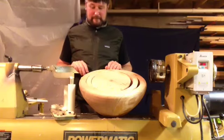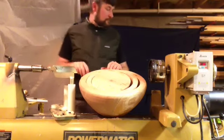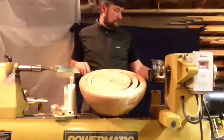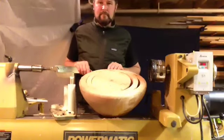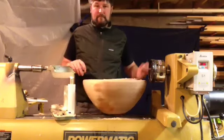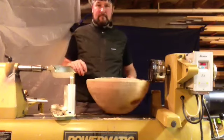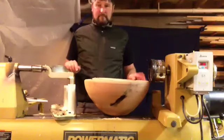Okay, the greener the better. Ron, when I do coring, I make sure I don't tighten my belt too tight. I let that become my emergency switch by letting the belt slip just a little bit. I don't mean loose, but not overly tight. I ran into a hidden knot in a large bowl like Brett has in front of him, and it bent one of my big cutters, but I was saved from catastrophic damage by the belt slipping.